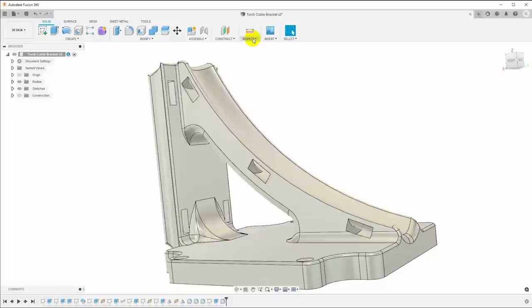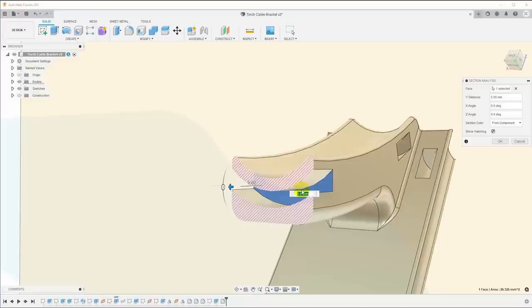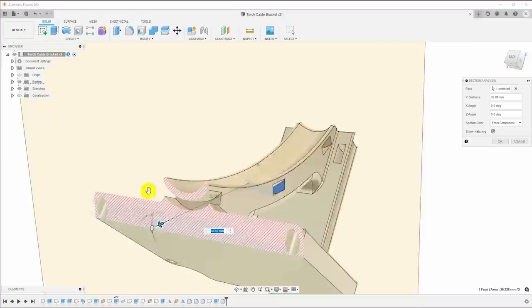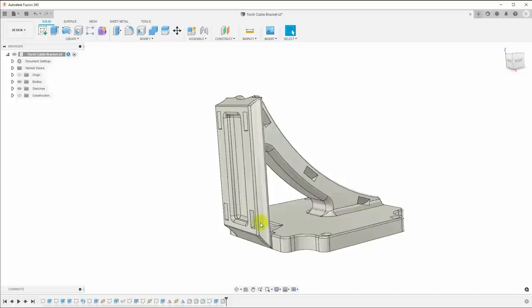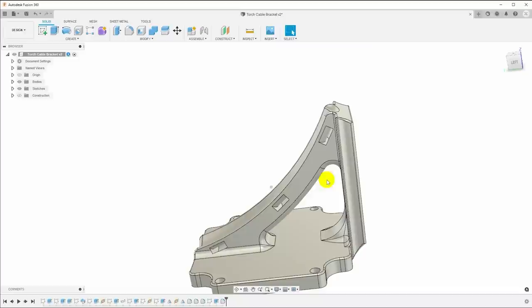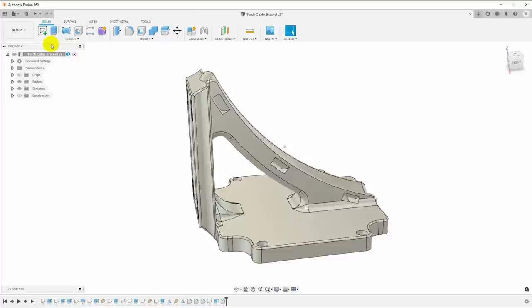I've come up to inspect section analysis and selected a flat surface to cut the model. You can see the zip tie channel is also curved and follows the curve on that top surface — there's one in the middle, one at the top, and one at the bottom, and the geometry gets kind of complex, but it's actually not that hard to create. The back support is a little bit wider to clear the plastic block on the back of the motor. There are channels on each side to hold the other two cables, similar curved zip tie channels to anchor them, and a hole in the back for aesthetics and to make the part lighter.